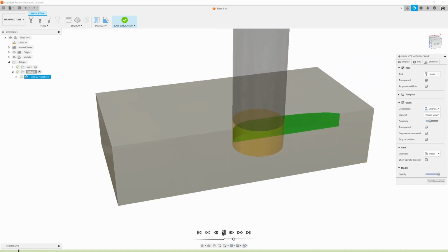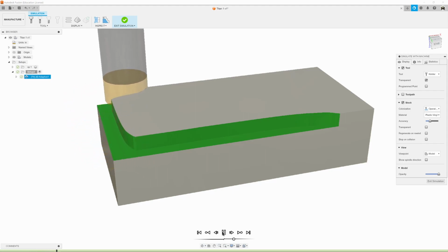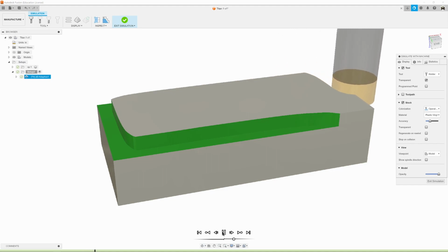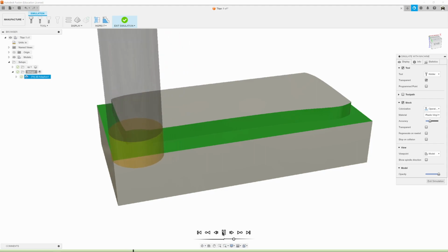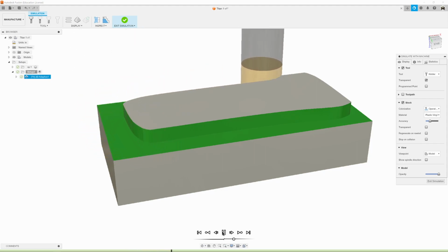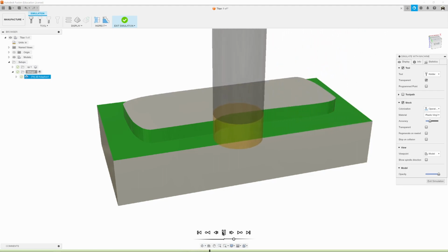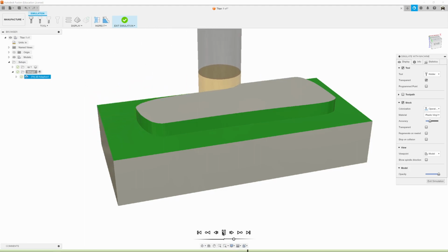It moves in, it starts cutting, taking that nice big chip that it can do, and remove the excess. Much faster than using a Superfly and more efficient. And it makes a really cool sound when it's machining. So a few more passes.